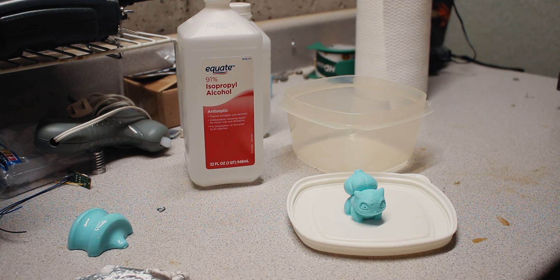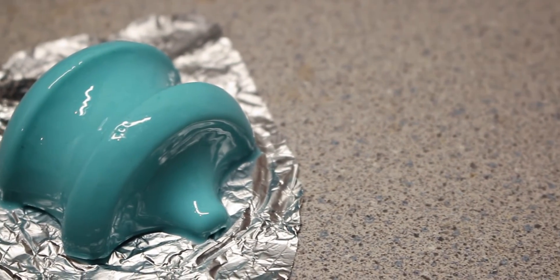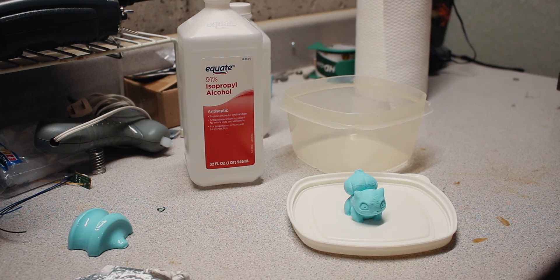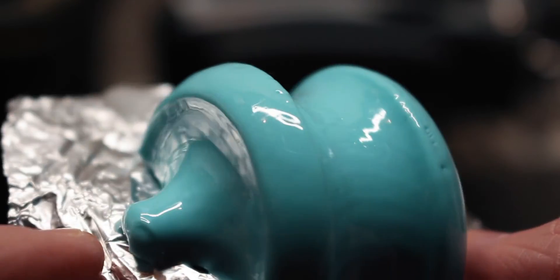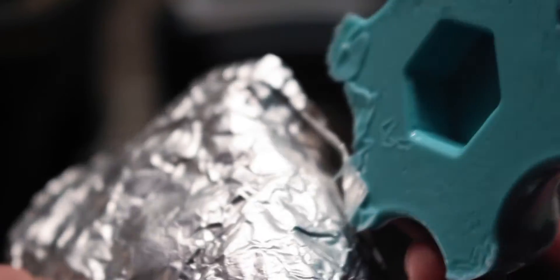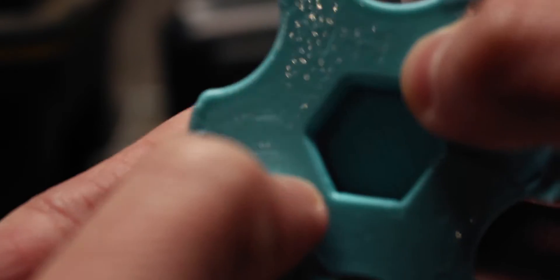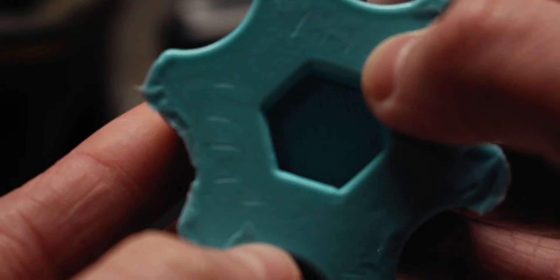After a few hours I was not getting the desired smoothing level I wanted, so I decided to leave it in there overnight because it was getting sticky and glossy, just not quite smoothing. This morning when I opened it up, it had substantially smoothed over and gotten a really nice smooth finish — about what you would expect from a two to three hour acetone vapor bath with ABS. So obviously the isopropyl alcohol works much slower than acetone, but it can still be worked around. The problem is when left in there overnight, it became very, very soft. I believe because it was exposed to the vapor for such a long time, instead of just the surface being attacked by the solvent, the entire part was affected. I can even leave dents in the surface with my fingernail, and it does have a much more rubbery feel. But it will eventually dry and go back to its normal hardness — just be careful with it when you first get it out because it will dent very easily.